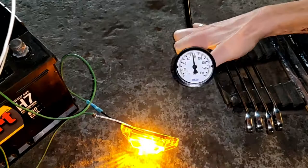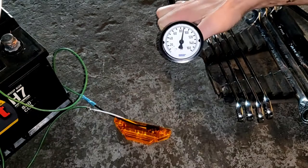As you can see, the pressure is going lower while we're simulating the air leak. When the pressure goes lower than 85 psi, the light comes on. Right now it's close to 90, and when it gets to 80 the light will come on. Yeah, at around 82-83 it's already on. If the pressure is higher than 85, the light is off.